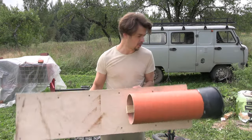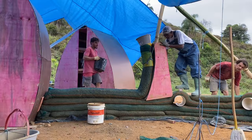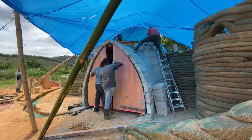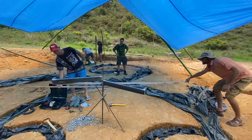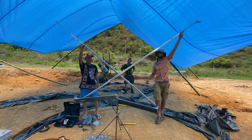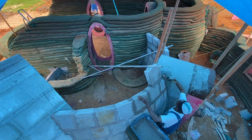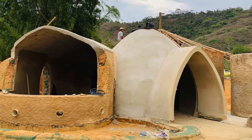Make basic tools that are necessary to speed up the one-man or multiple-crew construction. Make geometrical door and window boxes that you will use in an air-crete dome as well as the super adobe walls. Make a really cool 3D egg compass that we developed with Arthur, our host in Brazil, that allows two teams to work simultaneously laying bricks in an egg-shaped dome.